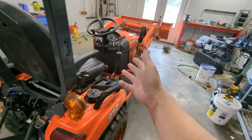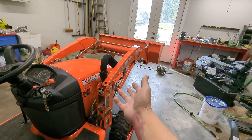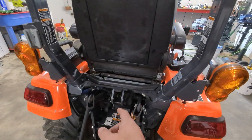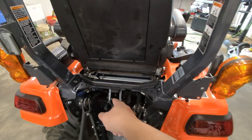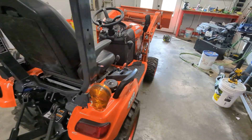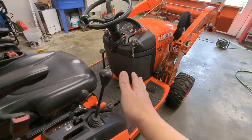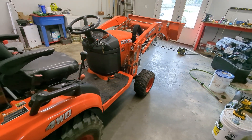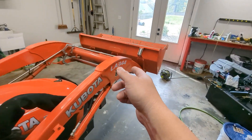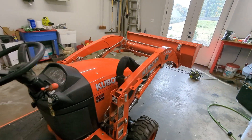This video is going to explain a little bit of why I think on the Kubota BX, we just do things like cylinders and maybe a third function upgrade or other upgrades that are useful to people who own this tractor, but not necessarily add flow. If there are just a huge amount of people that want to run a limb saw or something bigger as a hydraulic motor, maybe, but there are some challenges. This hose here is not really big enough to carry the additional flow — I think it's a quarter inch hose, and there's some other plumbing in here that's quarter inch too, though it does get to three-eighths out here. So maybe a hydraulic flow solution doesn't come to the Kubota BX, but cylinders are on the way.